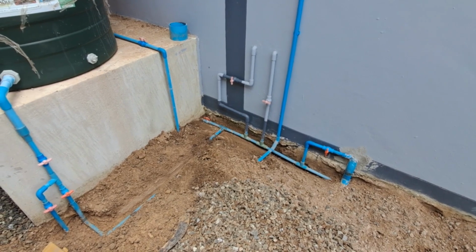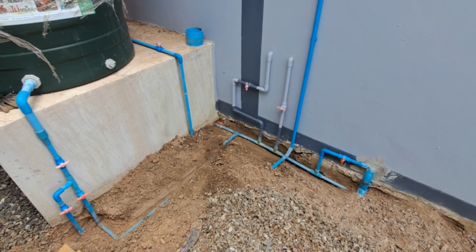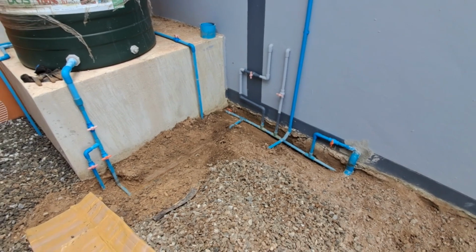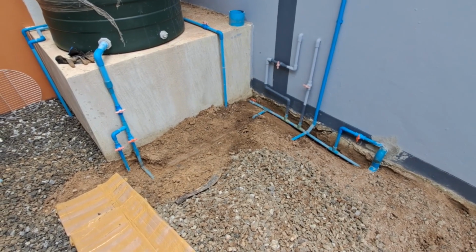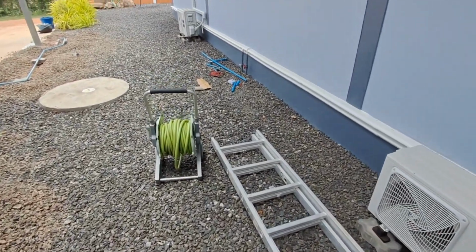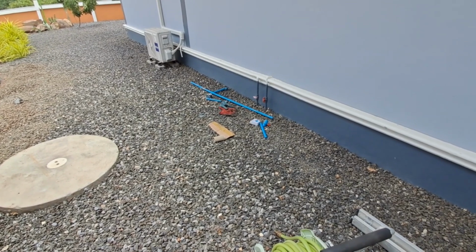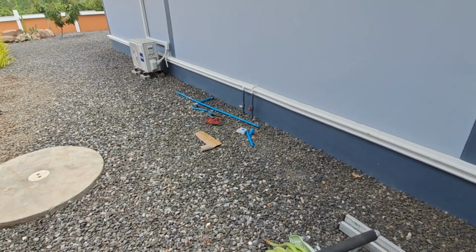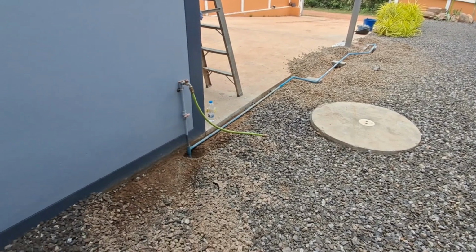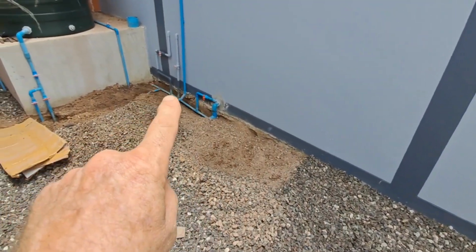And it hasn't cycled now for about 3/4 of an hour, having done lots of cycles after about 10 or 15 minutes. So I'm at a bit of a loss now. What I do know is that I cannot isolate that leaky valve there that's now not leaking, so I can't actually test whether I can take that out of the circuit to determine whether the cycling reoccurs along this batch of pipes.